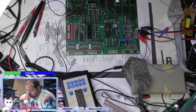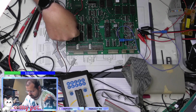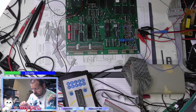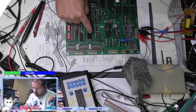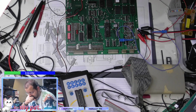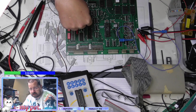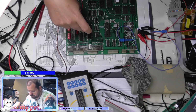So the issue was the lights were still stuck on, but I could read this. This was fine. This was working fine now. This was, and everything else is still working okay. The 6821 was being accessed. It was, traffic was flowing to it. Chip selects were being pulled high and low, but the output was completely stuck. So I went ahead and removed the 6821, put a new 6821 in, or new old stock 6821,